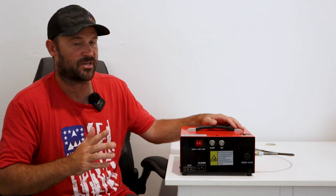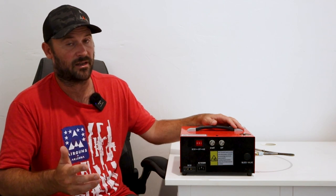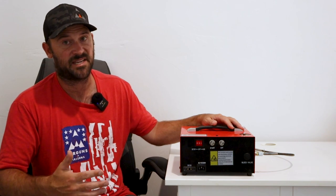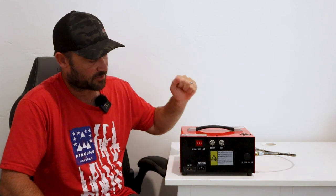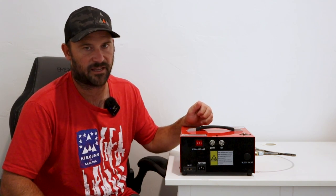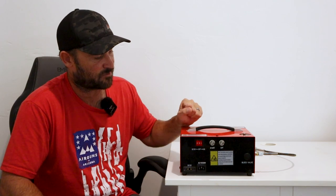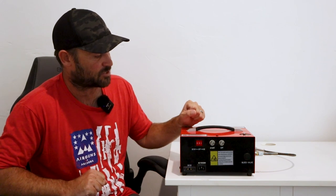What's nice about those larger compressors is they're much more serviceable, really high quality, and last a lot longer. More importantly, they can compress a lot more air. So if you have a carbon fiber tank, or plan to buy one, you can compress air for that tank. A unit like this is really meant to compress air directly to an air gun. They just can't compress the volume needed for a large tank like a 75 cubic foot tank. So if you want to get a tank in the future, save your money for the bigger compressors on the market.